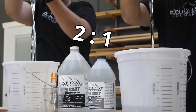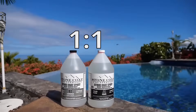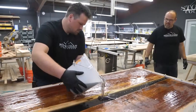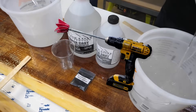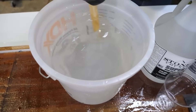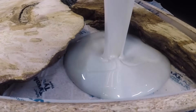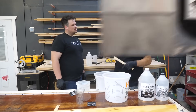This is a two-to-one ratio. A lot of our mixtures are a one-to-one ratio, but this is a different mixture — just like our floor epoxy is a two-to-one. That means two parts A to one part B. We've been asked to go in depth on the details and this is it. We use a mixing stick — you're going to notice the viscosity is very thin on our Supercast. We get very crystal clear results by mixing this with a stick and pouring it and torching it about every half inch or quarter inch.